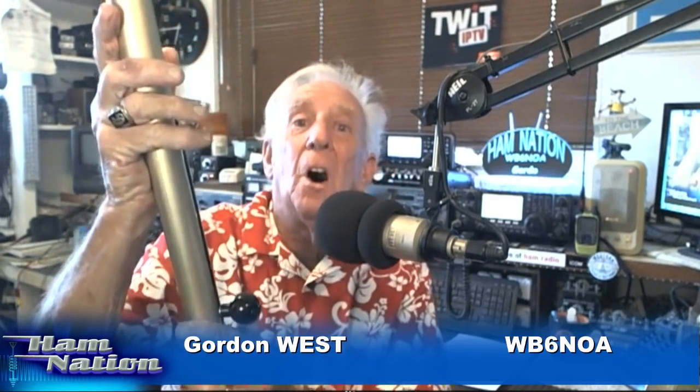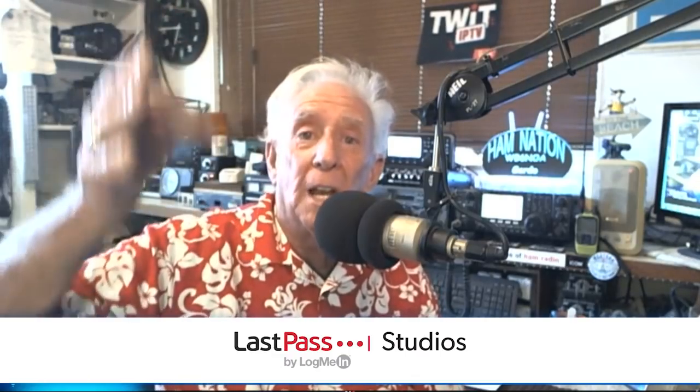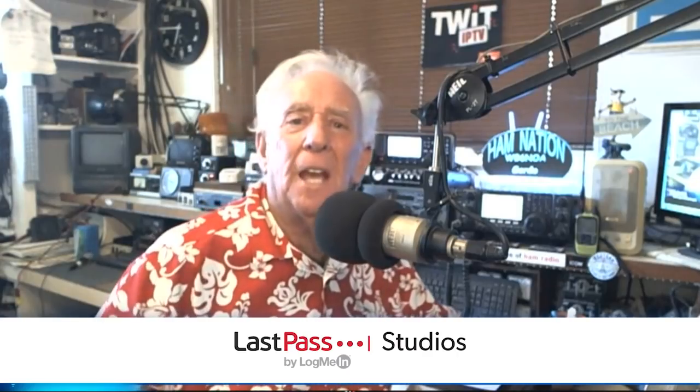The best part of this is, when I'm teaching classes and want to tell students what it's like to hit resonance, as I come through resonance, all of a sudden the HF radio, and it's an Icom, springs to life and you'll hear the noise. I can always tell a high Q antenna with steep skirts because it's got to be right on, versus the ham stick where you slide the whip in and out, and 1 or 2 inches doesn't make a difference. But the more of the high Q, the better the performance, and the more voltage you're going to get up to the tip end of that whip. So that's my antenna story.